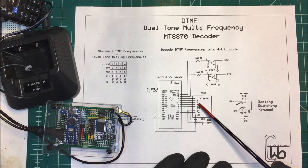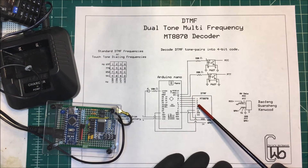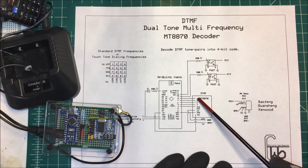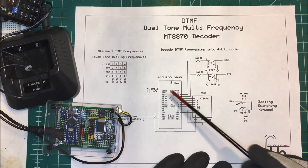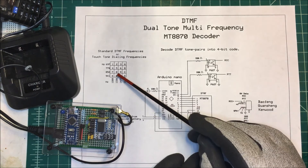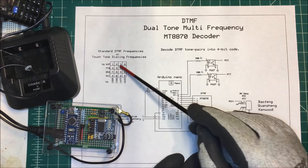The output ranges from zero through fifteen. If we press a one, we get binary one; if we press an eight, we get binary eight. There are LEDs on this board — pressing one lights up the LED corresponding to terminal one, and pressing eight lights up the four pin. Eight is the only number that turns the four pin on; one will come on with any odd number because it's in binary code.